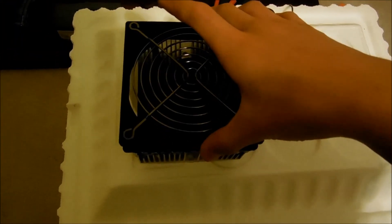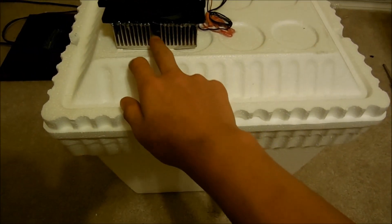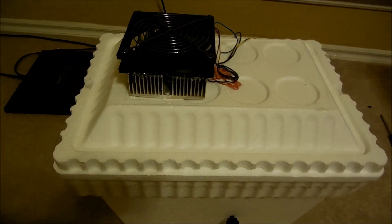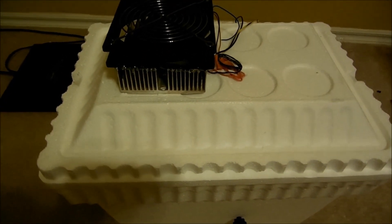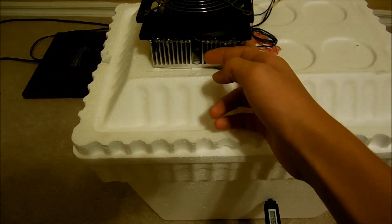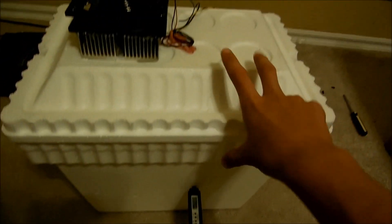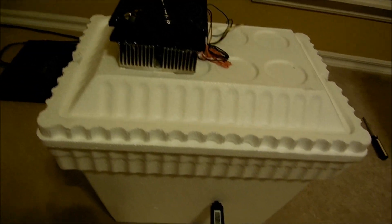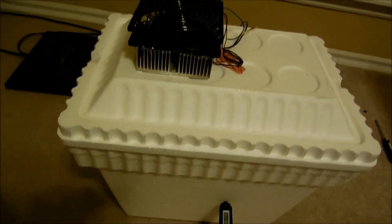This fan I got out of an old power supply. To make this, you order a little thermoelectric piece — you can get one for about $3.45 on eBay, that was the cheapest I saw. Just get one of those and find some heat sinks. You'll have to make sure it has good contact or it won't work and you'll burn up the unit — be careful torquing it down. I got a cheap about five-dollar ice chest from a convenience store, cut a hole in it for this, and put a fan on each side.